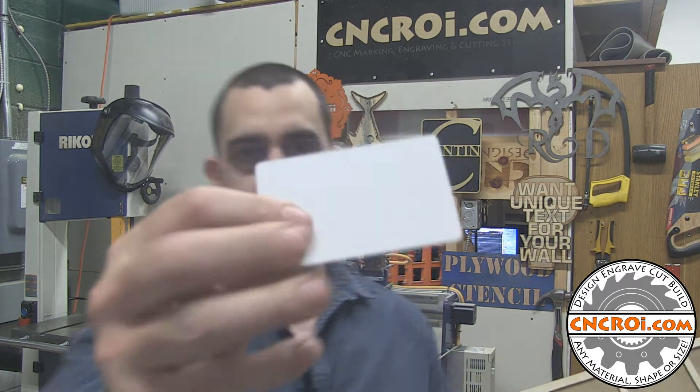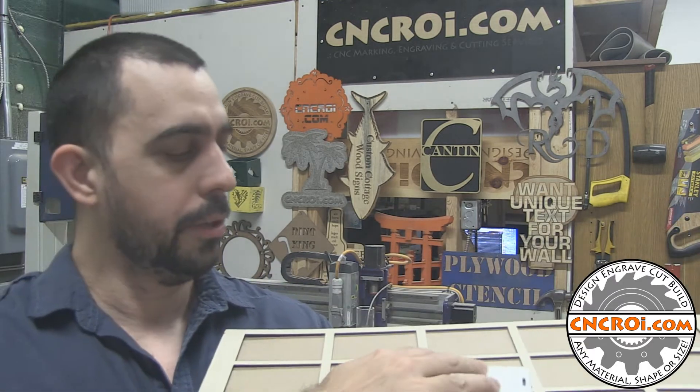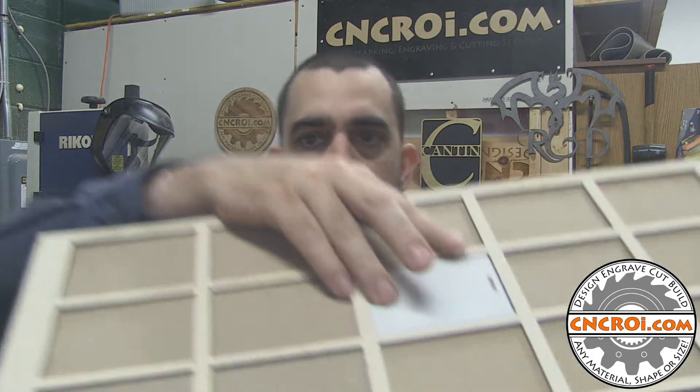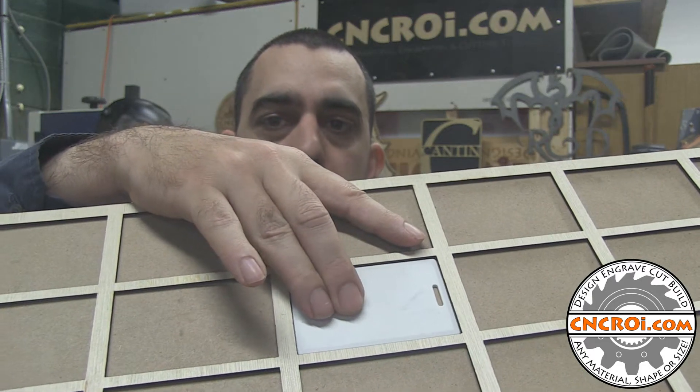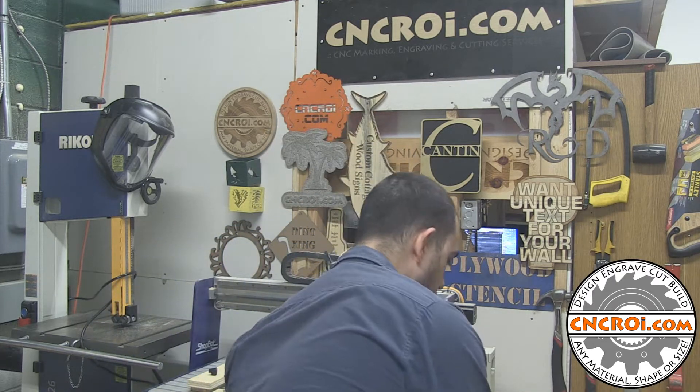In this case we basically have a business card size plastic name badge, and here's the jig — it fits perfectly. The fit is important because you want just a little bit of give. The reason you want a little give is because the operator of the UV printer has better things to do than go in with pliers and a screwdriver to take things out, or use a hammer to bang things in. You want roughly less than a millimeter, maybe a half a millimeter of give in X and Y — that just helps speed things up.